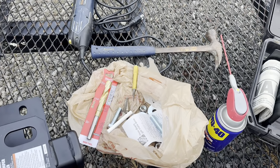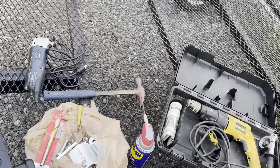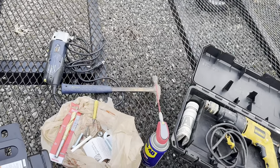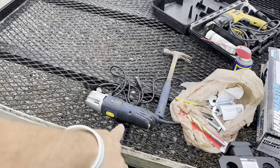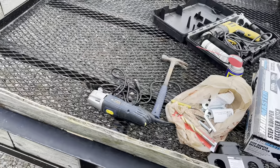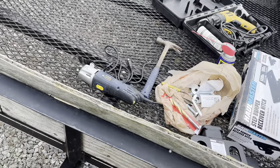Some of the tools we're going to use: a drill, a hammer with a pin to knock our center point, and you'll notice I have some plywood on here to keep things from rolling out. I need to cut that, so we'll use the oscillating saw. My first step is to cut out the part in that area.